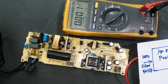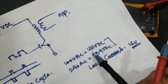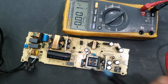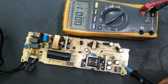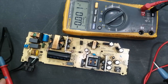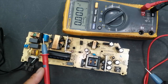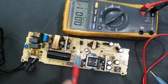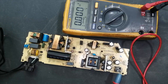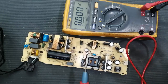Now if the input drops to 100 volts, we would normally find only 141 volts at the bulk capacitor and 5 volts at the output. But when we want to turn on the main section, the 5-volt standby applies to AC-DC-ON, the PFC circuit activates, and maintains 400 volts even though the input voltage is only 100 volts and the bridge output is just 141 volts. The PFC circuit boosts this to 400 volts so that the output current is maintained, we get a regulated output, and the converter efficiency remains stabilized.